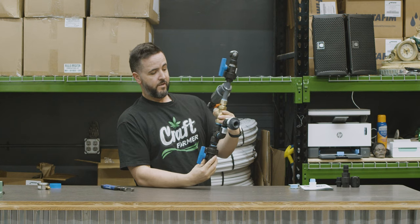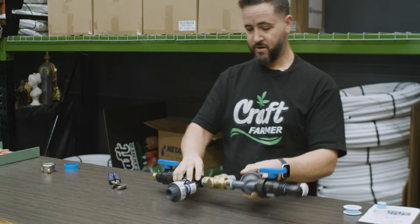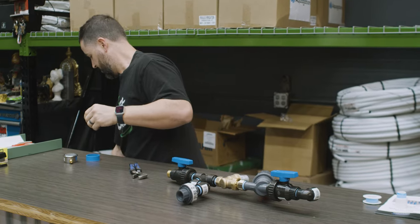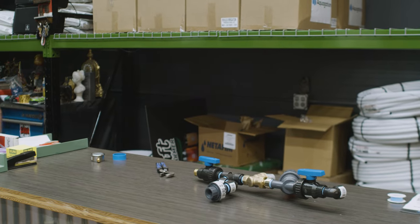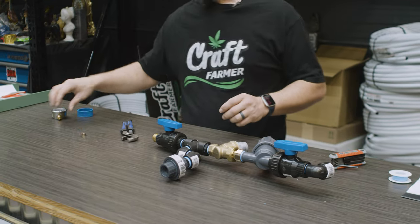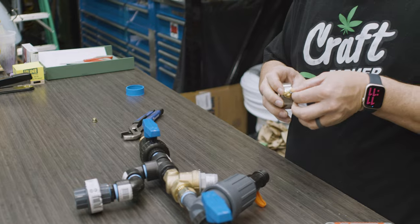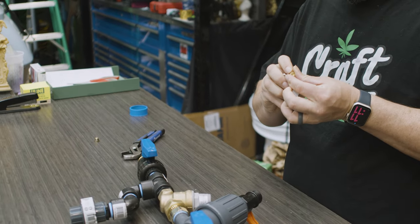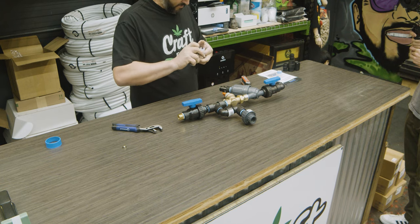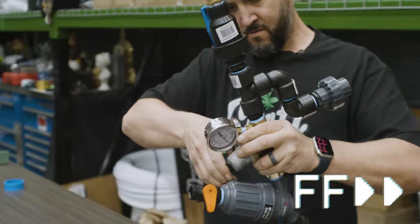There's our finished assembly kit. We're gonna pull this Allen piece out right now and put in our trusty pressure gauge. So we go ahead and take our plug out. It's a little challenging to wrap these with Teflon just because of how small they are. And remember, I wanna keep the tape out of the inside of that.